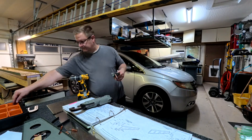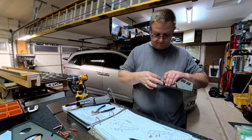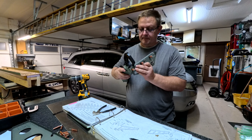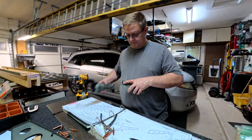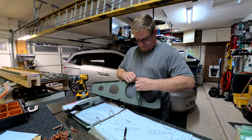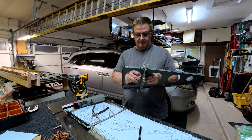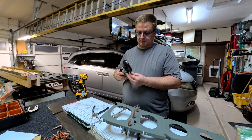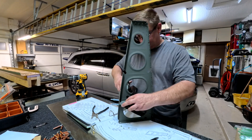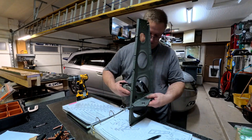When I started the wings I did the left wing first and set the right wing stuff aside, then went back. If I had to do it over I would work on both at the same time, because they are exact mirror images and I spent a lot of unrecorded time looking at the left wing instructions and then reversing everything in my head for the right wing. I think it would be easier to flip components over for the second wing simultaneously. For reference, I am now working on both the left and right fuel tanks at the same time, and so far it's been pretty easy.